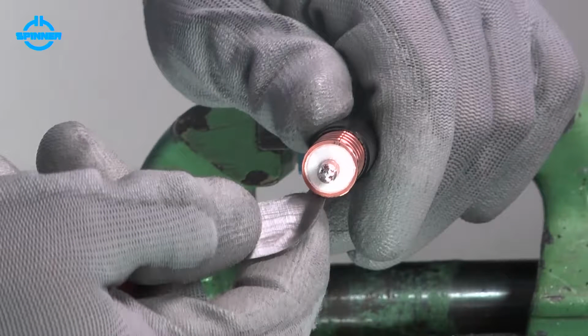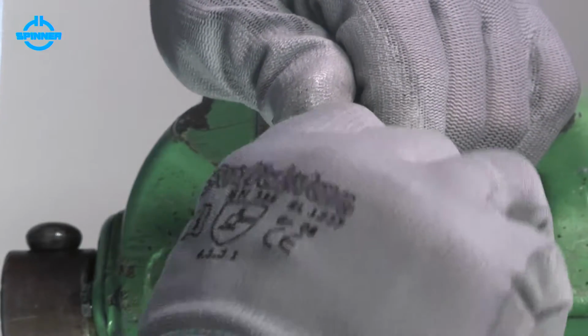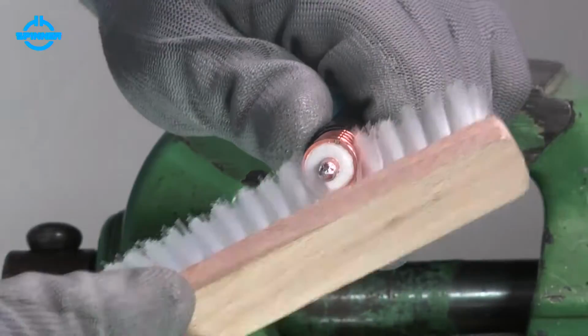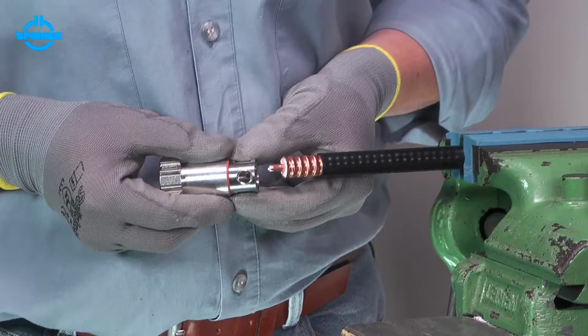Check the foam is fully separated and evenly spaced from the outer conductor. If necessary, use a knife or screwdriver to remove any remains of foam from the outer conductor to ensure an optimal contact. Remove any metal debris with a nylon brush. The connector is already pre-adjusted during assembly to support an easy and immediate installation. Therefore, please do not screw the pre-installed back nut forward or backward.